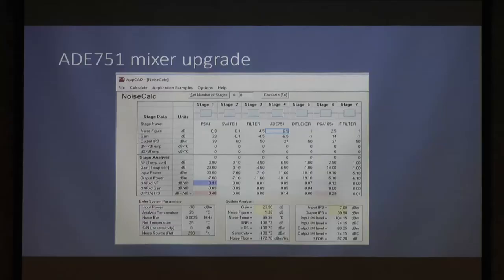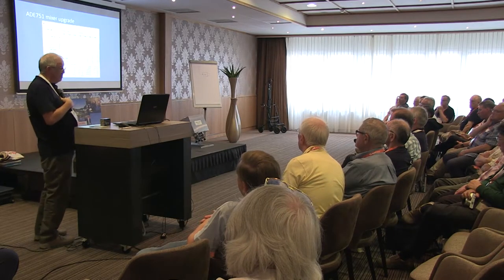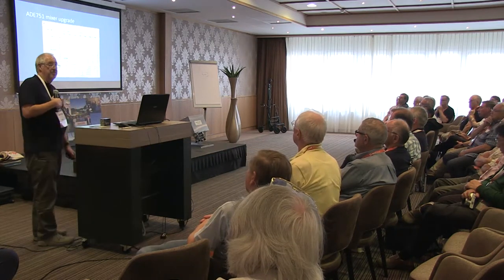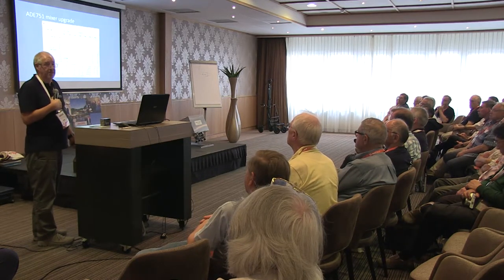If we move to the 751, then what we find is that the mixer really is no longer a real problem at all. It drops to 0.14. The front end now definitely becomes the limitation. And somebody, at least one person in the room, is going to say, oh, put a PGA 103 in there. That's a better stage than the PSA 45043. It doesn't fit on the board, so I haven't bothered to do it. If you want to do it yourself, do it. Let's see the results, please.